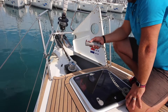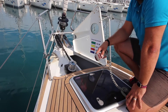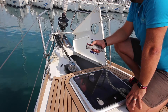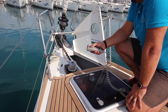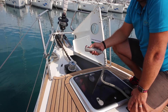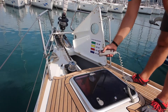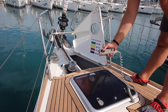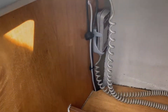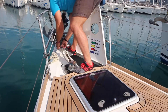When raising the anchor, make sure you pause every five seconds so as not to overload the capstan. If the anchor becomes strained, stop and wait for the boat to get closer to it. It's very important that the last part of the anchor raising is very slow to maintain control. Once you have finished, put the anchor control back on the cradle, close the hatch and locks firmly so you don't get water in, then tie on the safety line for the anchor.